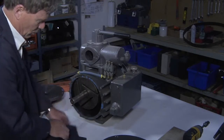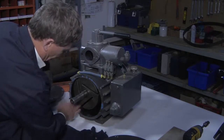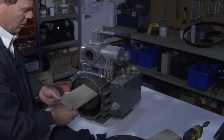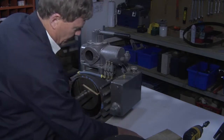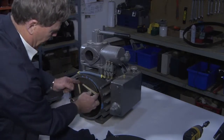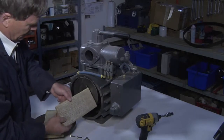You can use compressed air, rags, or a spray bottle with solvent — spray it well, just ensure that it's clean. This gives you an opportunity to check the wall on the body itself. Once the cleaning of the inside of the pump is done, you'll want to replace the vanes. One indicator that your vane ports are clean is that the vane should move freely in and out of the vane port. Quite simply — nice and clean, vanes move freely; that's a clean pump body.